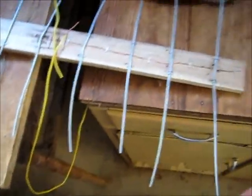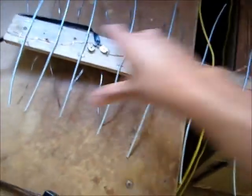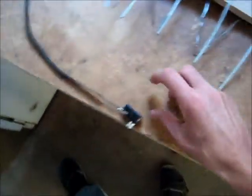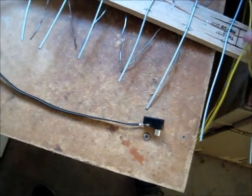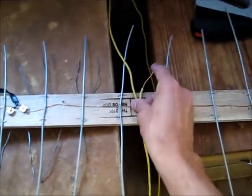G'day. I'm going to modify this DTV antenna. For VHF here where I live, it's around 180-something megahertz. I have to have something like this for an antenna to pick up the VHF, with a loop in the middle which is what you connect your main input to. These act as a reflector, and this just captures it all in that loop. Connect it at one end with a staple gun, connect this to the set-top box and it should get VHF, providing I hold it high enough.